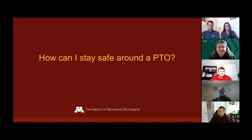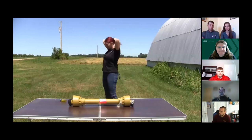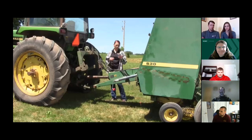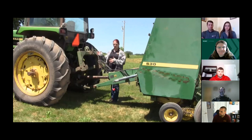As I mentioned before, entanglement is the most common type of PTO accident. One way to prevent entanglement is to tie up long hair and put a hat on. Along with tying back long hair, whenever we're operating farm equipment, we also want to avoid wearing loose, torn, or too large clothing, as it can get caught in different parts and pinch points. Also, whenever you're working with a PTO or any hooked up farm equipment — even if there is no PTO — never step over the shaft.